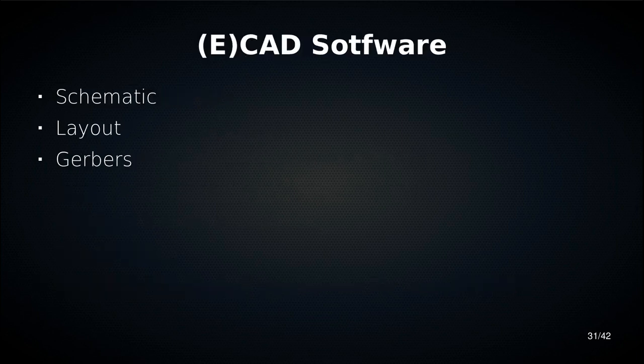Okay, so there's a type of software which, if you're on the artist side of the divide, you've not necessarily experienced before. This is electronics computer-aided design software: ECAD, EDA, Electronics Design Automation. It has lots of names. The names don't matter as much. What we actually care about is what it does. It deals with schematics, it deals with layouts, and it deals with Gerbers.